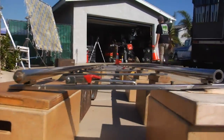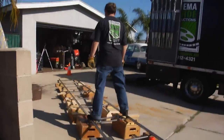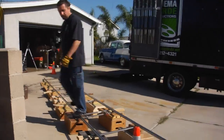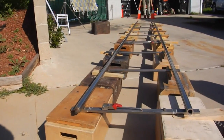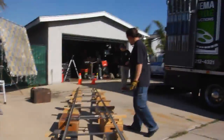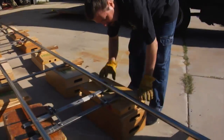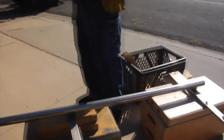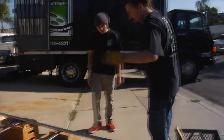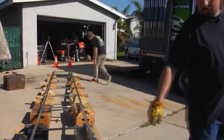When you sight down the length of it, it's level left to right as well as up and down. Every piece should be supported so that when the dolly tracks, it's not going to rock or bump. If wedges stick out too far on the side, you can wedge from the other side or wedge from the edges in a line to prevent any stickouts — because in a lot of situations when you push dolly, it'll have a push bar and you'll be on the side of it, not trying to step through the track or dodge all your cribbing.